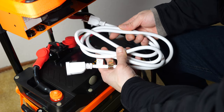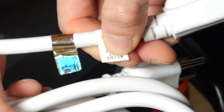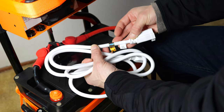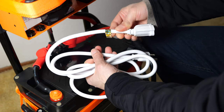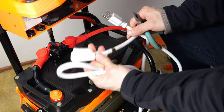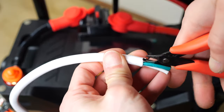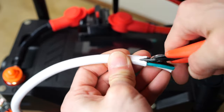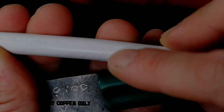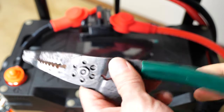I bought a six-foot extension cable that I can cut up. It's 15-amp capable, so up to only about 1,875 watts — a little bit undersized. If you want to run it all the way up to 3,000 watts, you'll probably need two of these in parallel. Cut it in half — one will be for the AC in and one for the AC out. Strip it very carefully, making sure not to cut any insulation on the inner wires. The wires internally are 14-gauge.